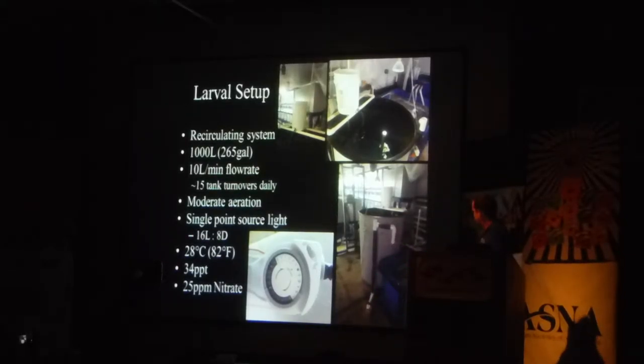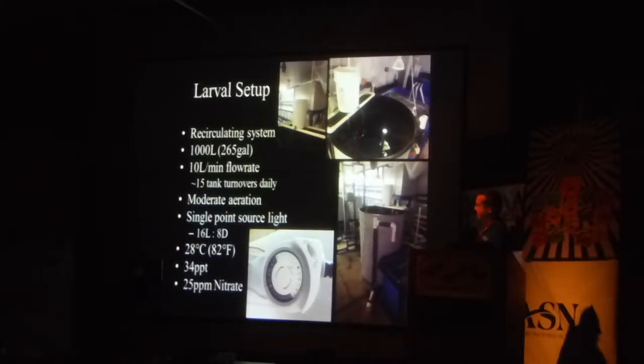So I put it in place. This is our sump right here. I put it right next to the sump so we can just have this really easy overflow back into the sump. It's hard to see. So this is our header tank up here, this tank up above. I just had a siphon that comes out of that and that's the water coming into the tank. It's kind of scary when I think about it now because if we lose power, that header tank — the water running drops and then that siphon is broken. So in Florida we had a lot of storms and there's always the possibility that we're going to lose power, but fortunately that didn't happen during this run.